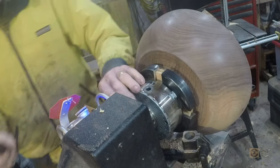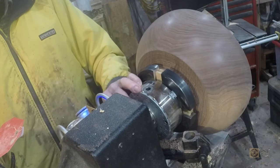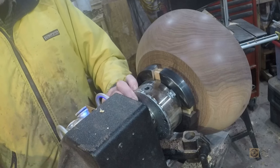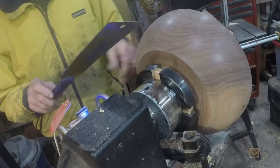Too much play in the spindle lock, so I used the indexing lock instead. And I attach my magnetic stop sign in front of the controls so I don't turn the thing on while it's locked up.